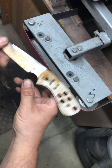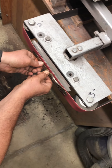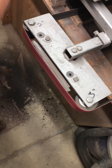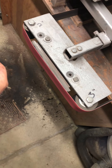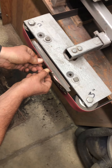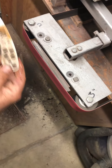That means that this piece of steel wasn't flat when I got it — it was bent a little this way. I had some material left over on this end and now it's in the middle, so that tells me my bar stock wasn't flat when I got it, which is no big surprise. I mean, it's coming out of a mill — it's not pre-sanded or pre-milled or pre-anything. It's just off the roller.